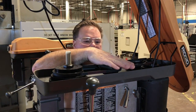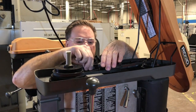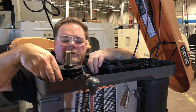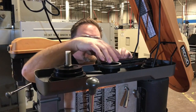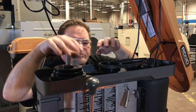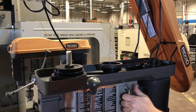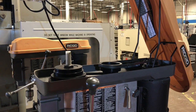We don't have to take this belt off because we're moving downward. Move this guy downward on one, then it falls down. Line it up — we're on. Pull the pulley back, pull the motor back, and lock the motor down.